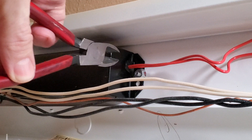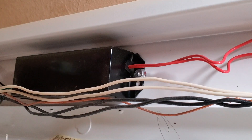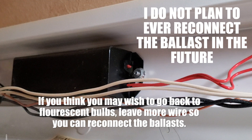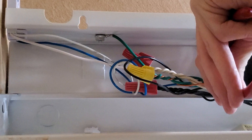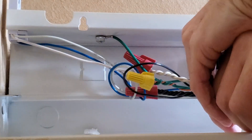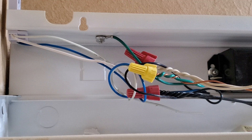I'm going to cut these wires as close to the ballast as I can because I need that length to reach the hot wires over there. I'll cut this side and then cut the wires on the other side — working left-handed, which is not easy. Okay, all the wires have been cut to the ballast.